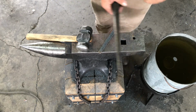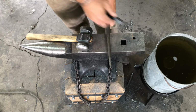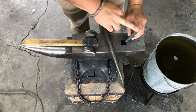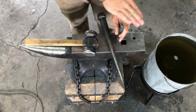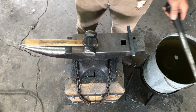And also, in between heats, because you're not going to be able to do that all in one heat, I can take that, and you'll have your piece hanging on there, and you'll see in the video, I'll be able to hammer down and slowly work that top. Your top starts off square, and as we're pushing this out, it's rounded. So to give that a more refined look, it's going to start rounding that top every time you loosen it off the tool. You're also going to see, even though this is a larger tool, keep it cool.